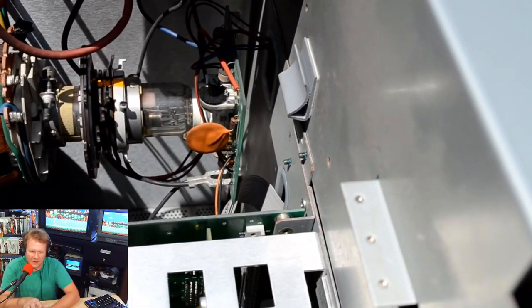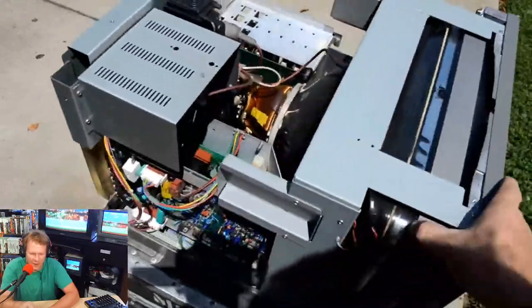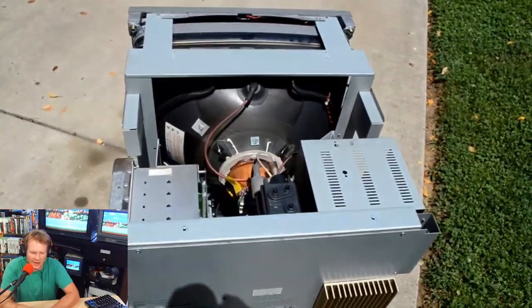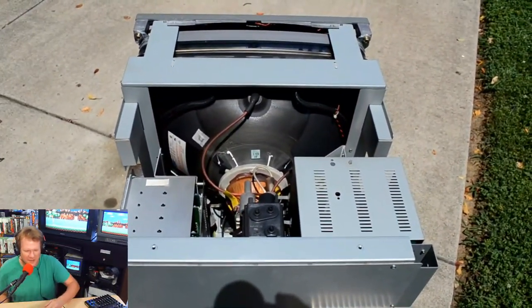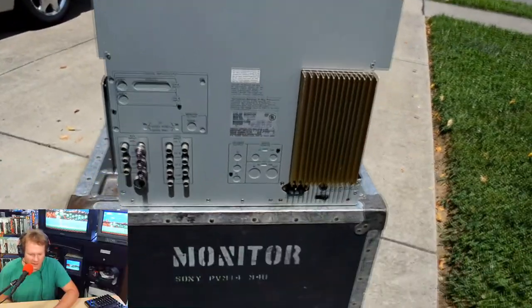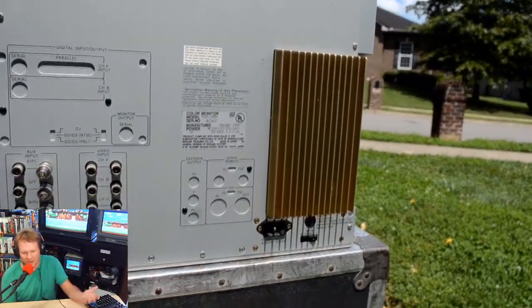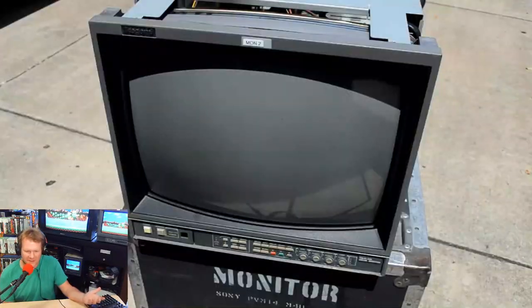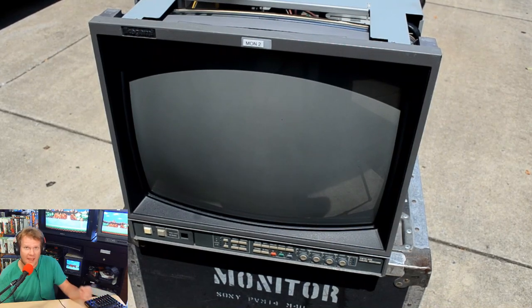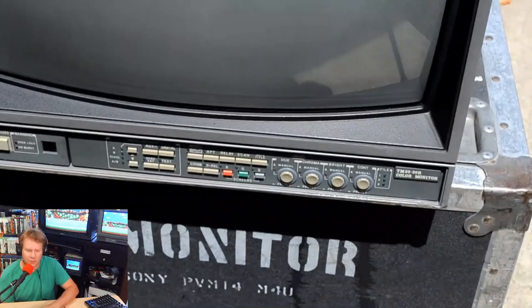Here's a look at the back of the monitor, where the flyback is separated on its own. The flyback has controls — there are three different focus knobs, which is a lot for a flyback. Most of the time they have one, sometimes two, but I've not seen three focus knobs before — kind of interesting. There are some additional build-outs you can probably add to this monitor, but the standard setup is three composite video inputs with relay outputs, and then you've got an RGB input, which can surprisingly be switched to component input if you want.